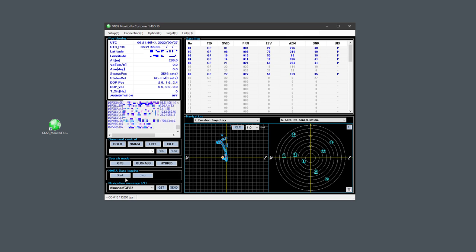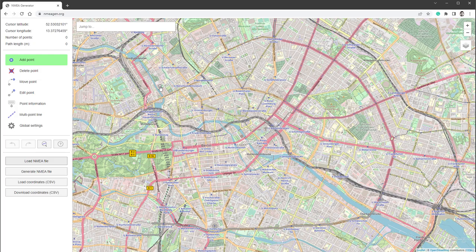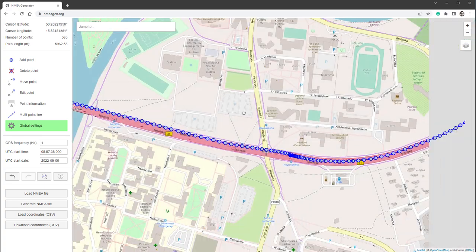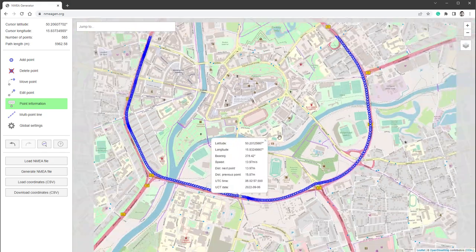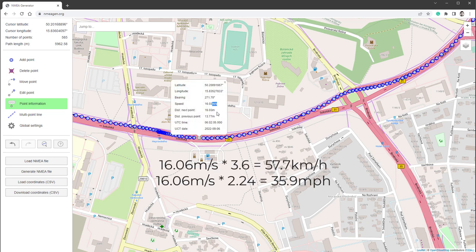While I was driving I clicked the start logging button, which takes the output from the sensor and saves it into a text file. This is the content of the text file — each line is a separate NMEA message. It starts with the message type, always ends with an asterisk and a checksum number, and in between there is data. There's a handy online tool called NMEA Generator. You can load the generated NMEA file and it will show you the points on the map. You can see I was driving around the city — zooming in shows where I was slowing down for traffic lights. Clicking a point gives exact data for heading, speed, and position — though speed is displayed as meters per second, not km/h or mph.